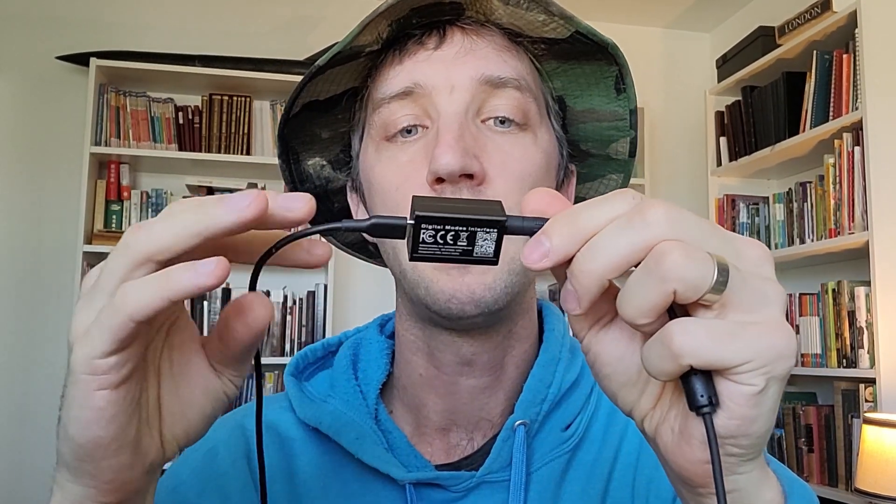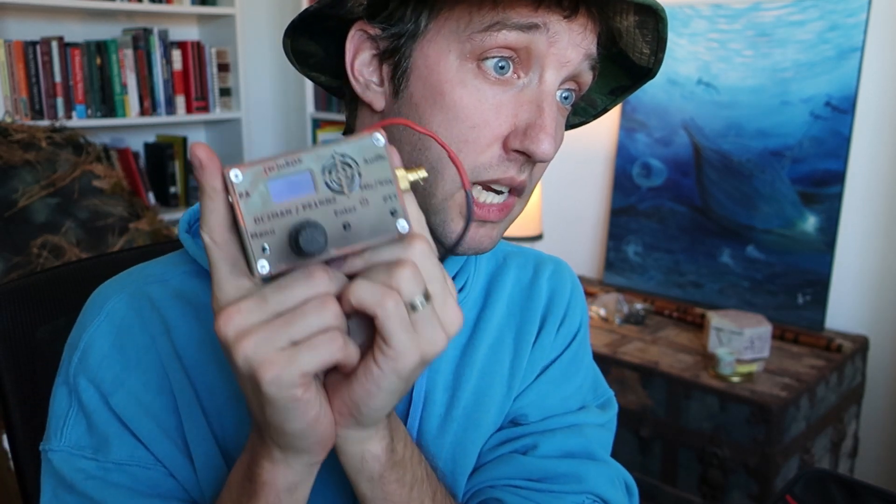Things that you'll need are the radio, and try to opt for the battery attachment — it uses three 18650 batteries to get you up to 10 watts. Then you'll need an audio device to connect to your computer, like this DigiRig right here. Ideally this would plug right into your computer with the USB and bypass any need for external hardware altogether. However, this version doesn't work in that way yet. I tried to follow a video that updates the firmware so that you can connect directly with the USB, but either I'm not technically apt enough, or it's not ready for that yet. But they are working on that, which is going to be an important step in this ideal world of mine where we have a plug-and-play cheap solution for the average man.